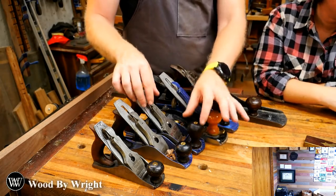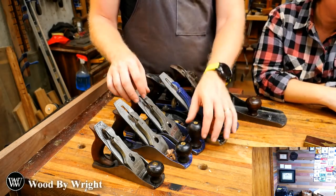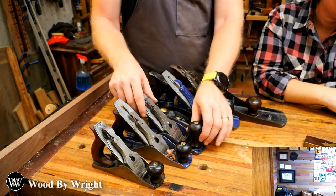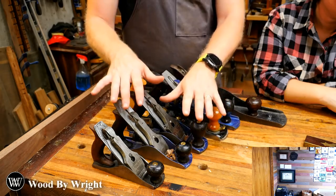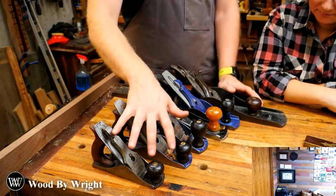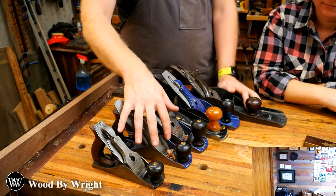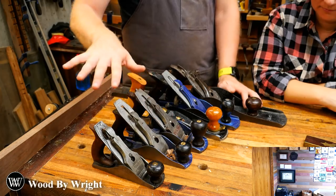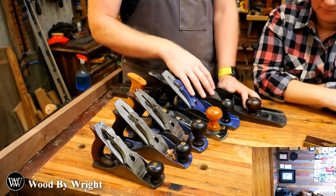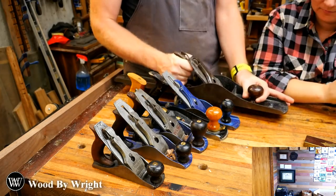And you'll set this up perfectly so it has the finest, smoothest, tightest, beautiful shavings. And with that, you can go against the grain or on figured woods, and you can really get a clean, finished surface. This has already made it flat, and you're taking off so little with that last one that it can glide over the wood. And so you use this for your finishing surface, and your finishing surface might be a little bit undulating, but not enough that you could even feel. Whereas this will tell you it's flat.